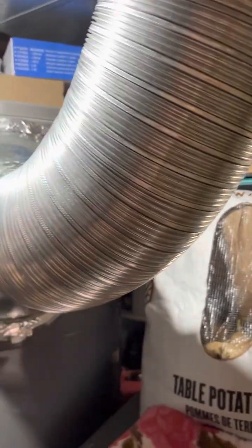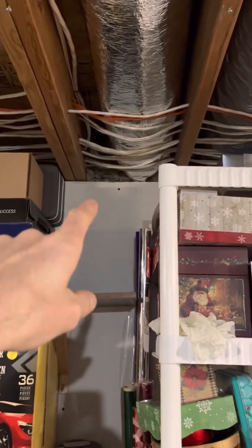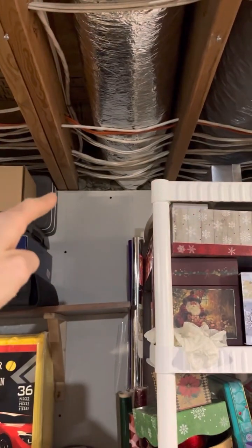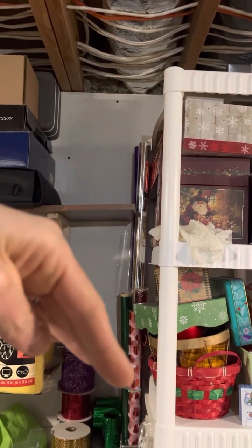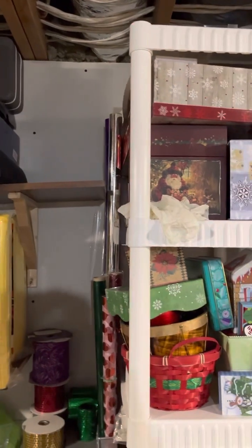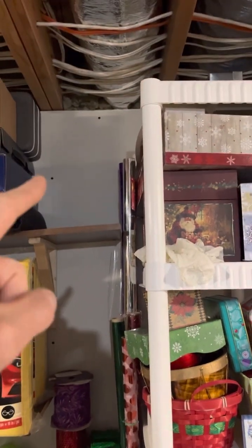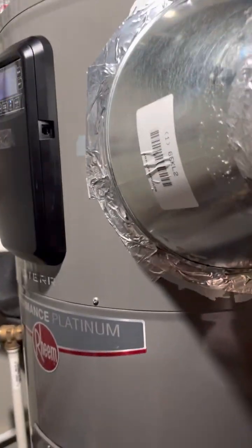I connected it back up with the insulation off, so it'll get heated a little by the room heat exchange. What I ended up doing is putting the butterfly damper — the one that was in the pipe — back on the outside at my termination. I actually cut up the 45-degree slope of my termination because I have 12 feet of deck over top of it. I folded it up so I could put my butterfly right against the grid and screwed it in with the sides of the terminator. I taped and sealed it, so now it won't let any air push back in from outside.